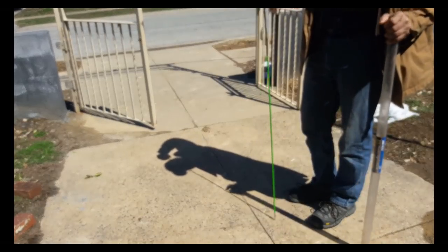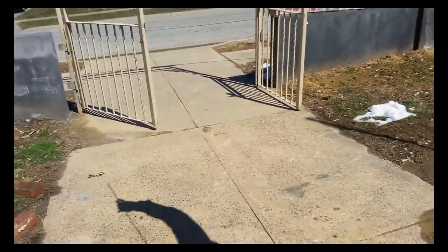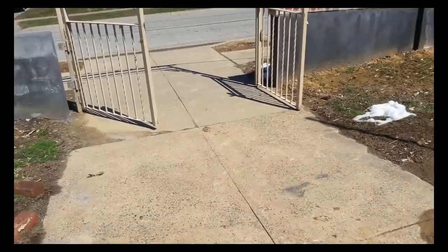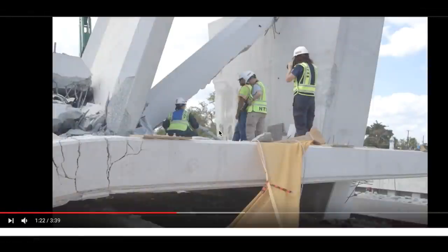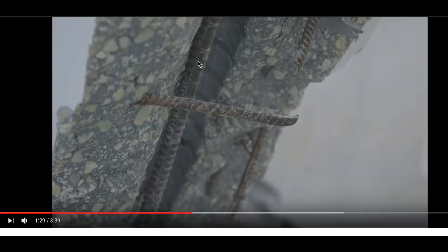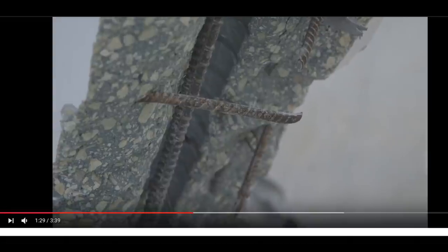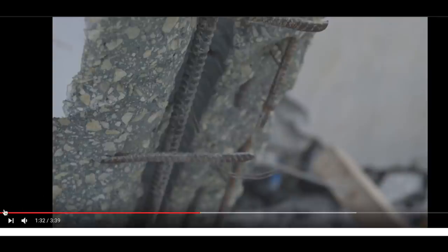This piece of reinforcement. You can discount my reinforcement all you want, but as you can see, it doesn't take much to make that act as a contributing factor. Okay. Remember, I've always said that I stand in a position that number one rebar, number eight rebar, I also think that's contributed to the failure. We've got a hairline crack here. Now here we go here. Hairline. We've got a crack there. Here we go again. It's blowing through this part here.